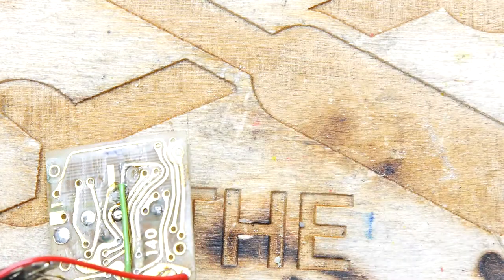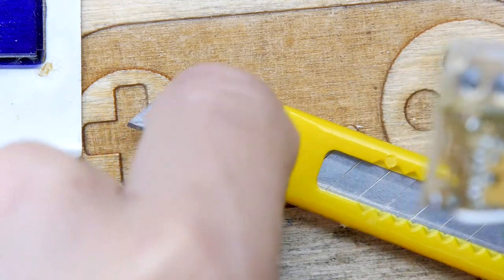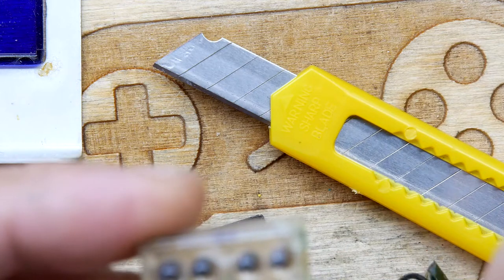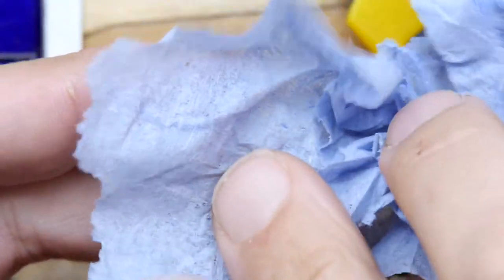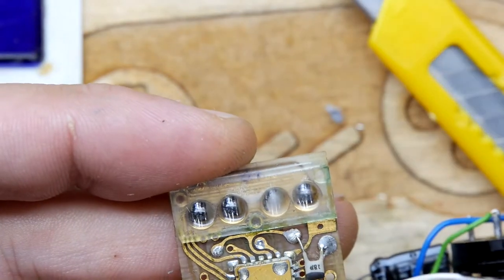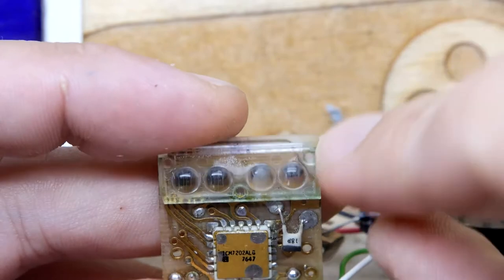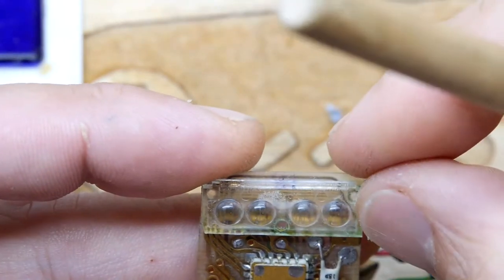I'm going to stop the video and just keep buzzing through. Getting desperate here — I've removed the actual crystal and its separator disc. Underneath there is some green goo — it's the only place left, apart from under the chip, where corrosion could be hiding. So I'm tackling it there and hope that's going to solve the problem. If this doesn't work, the only other two things left to try are underneath the chip and underneath the screen where you've got your little LED module — I'm less inclined to mess with those, but we might have to.